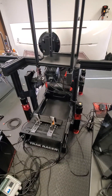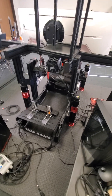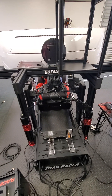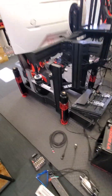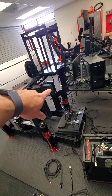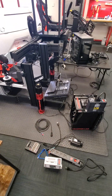It might actually be better from a noise, EMI, or ground loop perspective, since everything would be constrained to a single point. You'd want to make sure the enclosures have metal plates around them to contain any radiation emitted by the servo drives. The problem isn't constant noise — it's that when a strong motion command fires all motors simultaneously, it can generate noise that momentarily interrupts communications, causes your VR to gray out, or drops USB connections for peripherals.